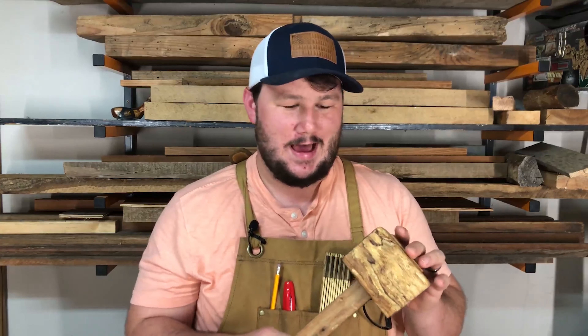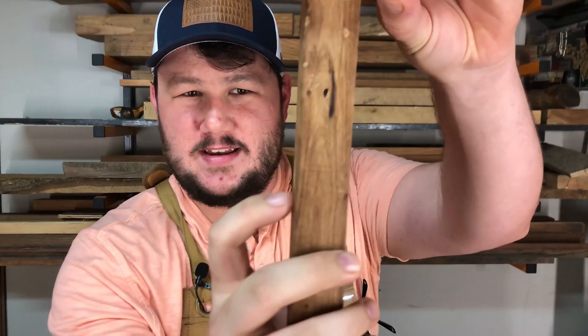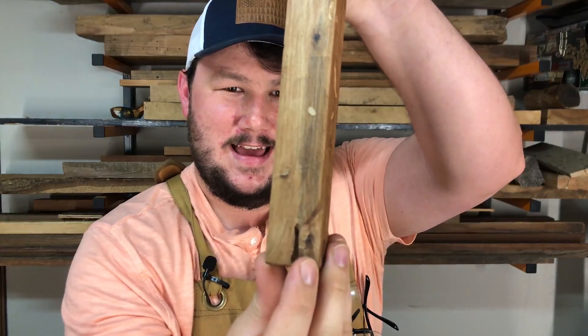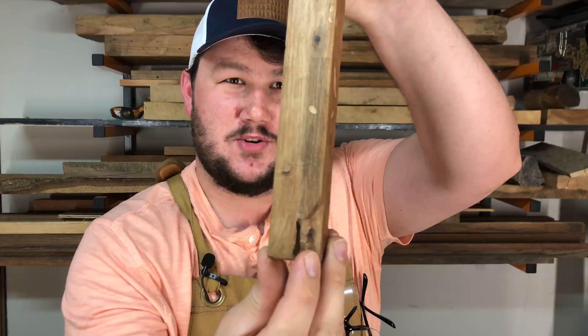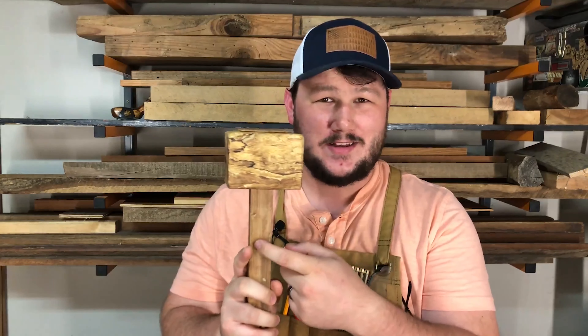Overall I'm very pleased with the turnout of this mallet. That Danish oil gave it a perfect natural finish and I love the grain of this pecan — I think it is just gorgeous. You can see a little bit of the termite damage, but ultimately I think that's beautiful. I'm even pleased with the little top piece I added to hide the mistake in the mallet head. This top piece is glued directly to the handle, so if the mallet head busts or the handle snaps I can replace either one. Feels great in my hand and I cannot wait to put it to a chisel. If you liked this project, be sure to subscribe, ring that bell, like this video, and add some comments below — this was Hamilton Handmade.